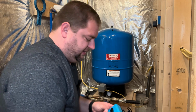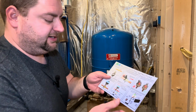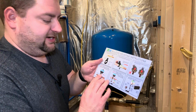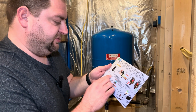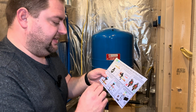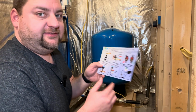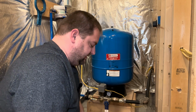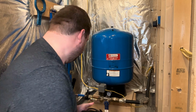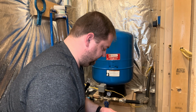All right. Next is installing the motor. The one thing they tell you here is to make sure that the motor pivot point is directly above the valve pivot point. So in this instance, you're going to slide it up or back in the slot so that the pivot point perfectly aligns with the valve pivot point. So that should be pretty easy. And that would be this pivot point right here. And then we're going to go ahead and fully tighten the screw that goes in that slot.